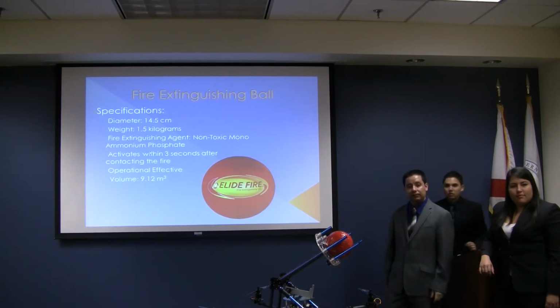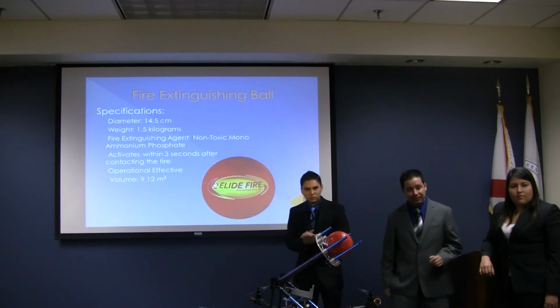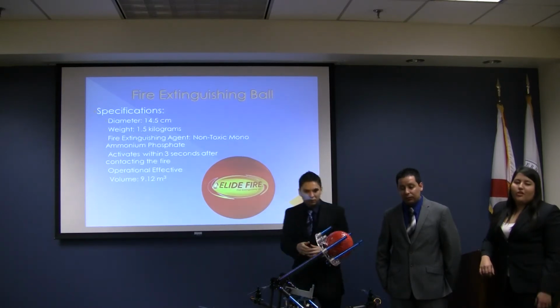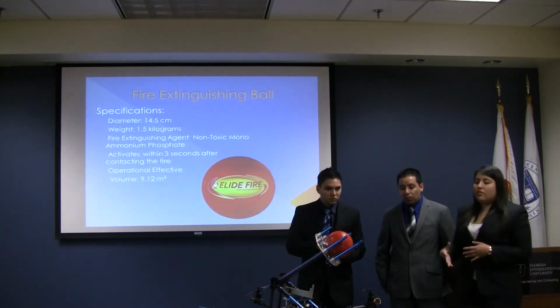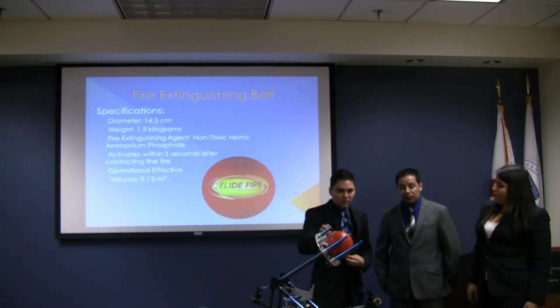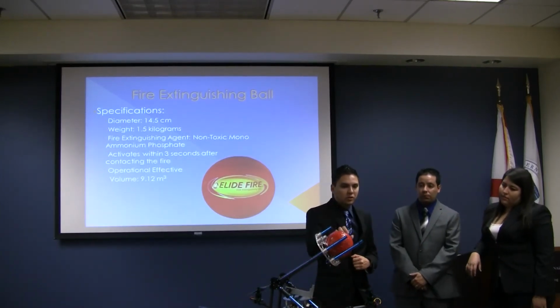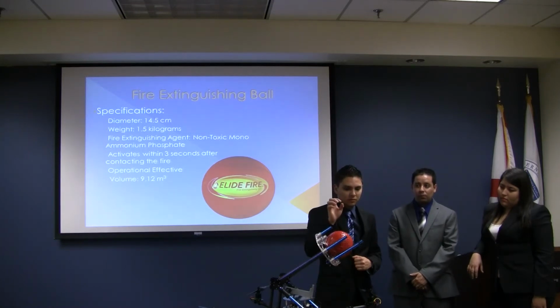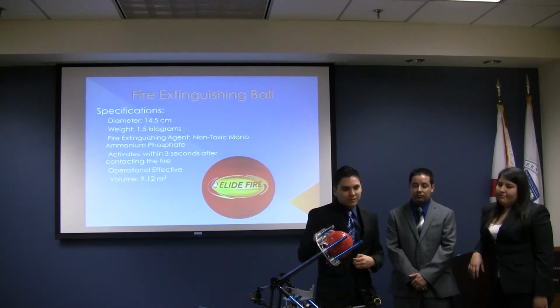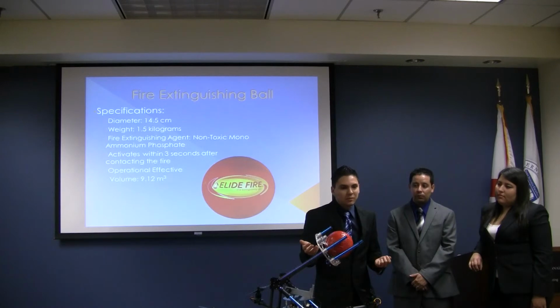Okay, unrelated question. It's basic Newton's third law. Once that spring launches a ball, there's going to be a reaction on the quadcopter. How is that taken into account for stability of the quadcopter? We're using our flyer and so forth. And also we tried to reduce the weight as much as we could by reducing the thickness of the launching ring. During the testing, we thought about putting springs here to work as a softening, how do you call that? A damper? Yes. It worked, but it wasn't making that much of a difference.